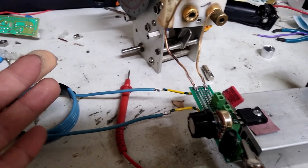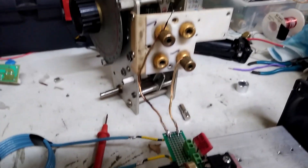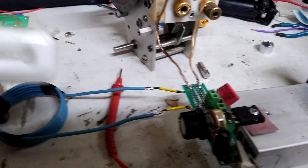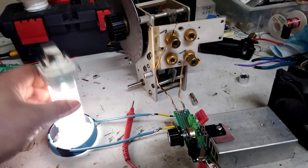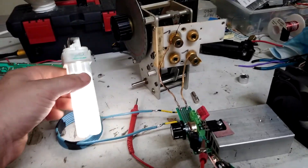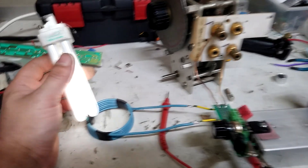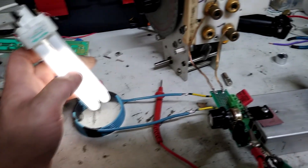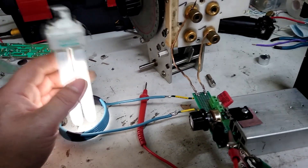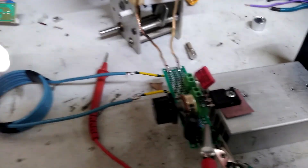It really wasn't until I got onto this high frequency circuit using Tesla Unmere's schematic that I really started messing with this. It's just kind of funny because this in itself is pretty cool. I'm at 25 volts now, but it'll run way lower than that. So here's just the LC oscillator by itself. Obviously this is putting out RF power, and this will be pretty much the same thing as those little slot jammer circuits, but they're just using high frequency transistors with a little feedback winding. You more or less get the same results with this oscillator.